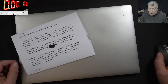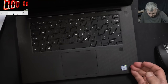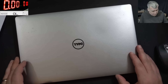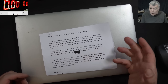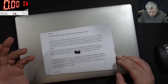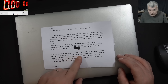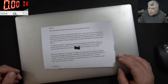Hello, we are back and this time we have a nice laptop to repair - a Dell XPS i7 7th gen, but still a decent laptop. Now this laptop has two problems. The customer says the USB-C port was only working when moving the plug. He removed the port. Also, the laptop is not charging on the DC jack - the charger is plugged in but does not identify the rating or power of the charger and will not charge.